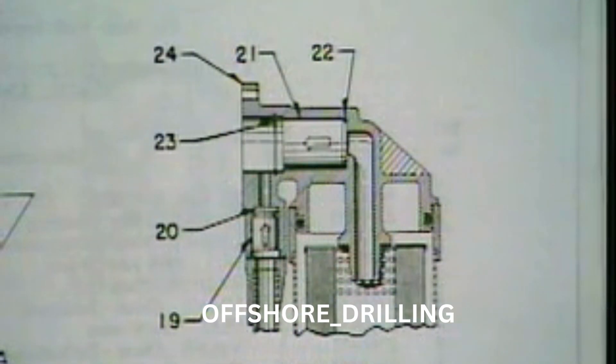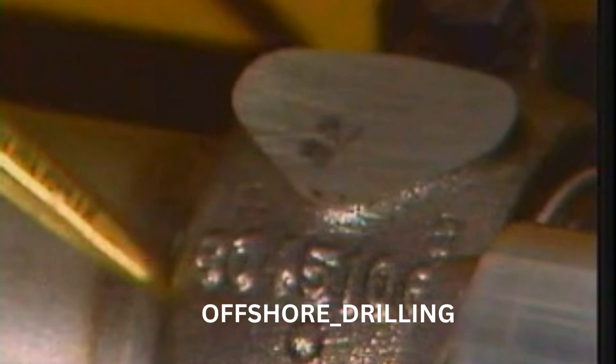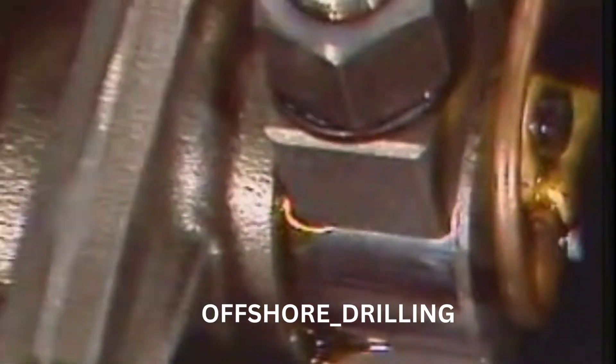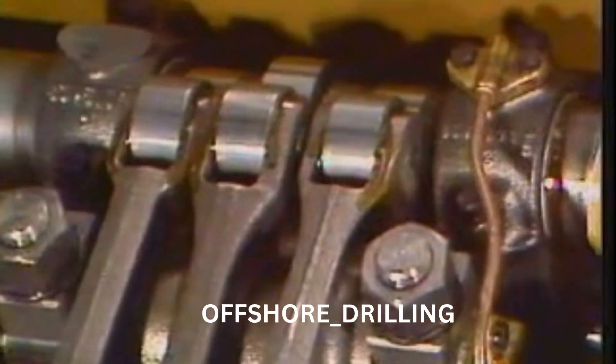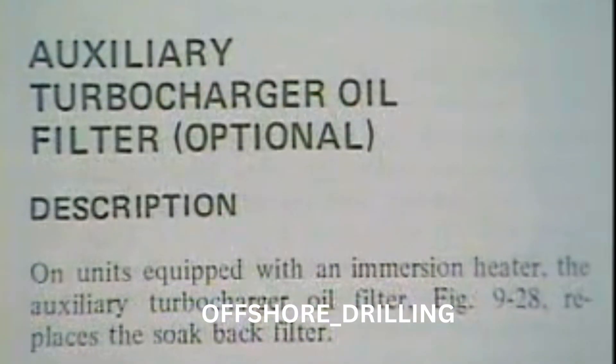Take care when you reinstall them. If you detect oil coming from the camshaft bearings with the engine shut down and the soakback pump running, you have a clear sign that the check valve in the filter head is jammed open or installed backwards. Now remove, clean, and inspect the 30 PSI check valve in the auxiliary turbocharger filter system. Replace or reinstall it as needed.